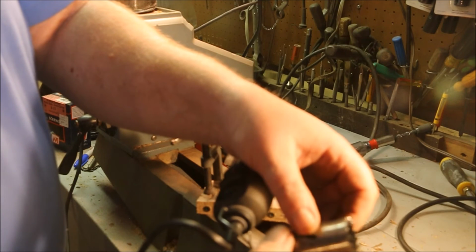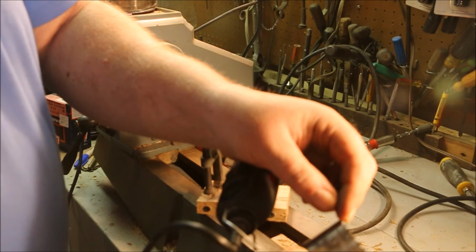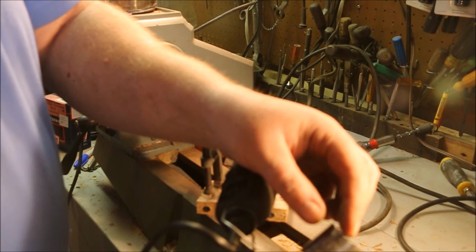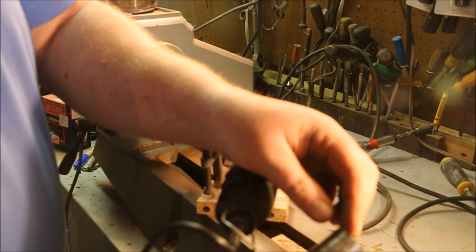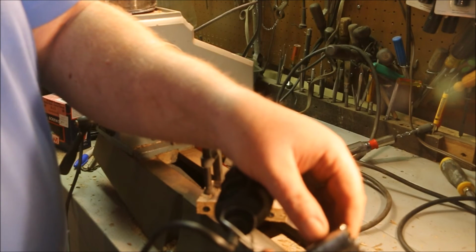And these missing teeth, it's going to take a lot of sharpenings, but if I just follow the same pattern, those teeth will eventually become tall enough to become full-sized teeth again. I don't need to go through and grind all of them off just to get those teeth back where they belong. Two missing teeth really won't make that much difference.